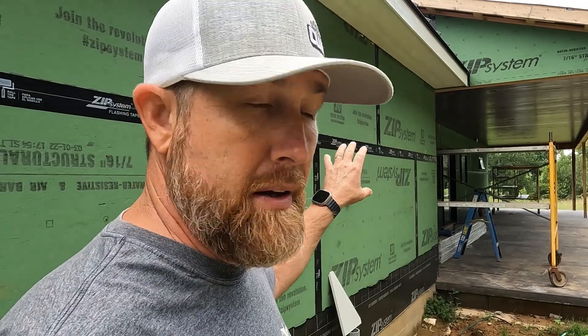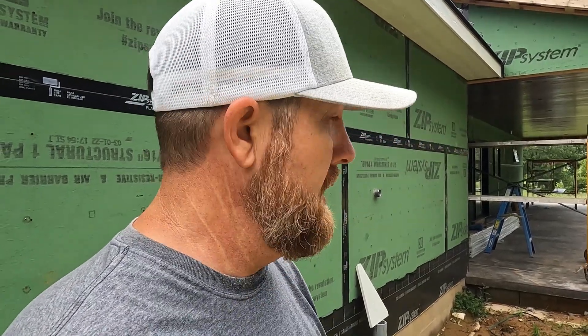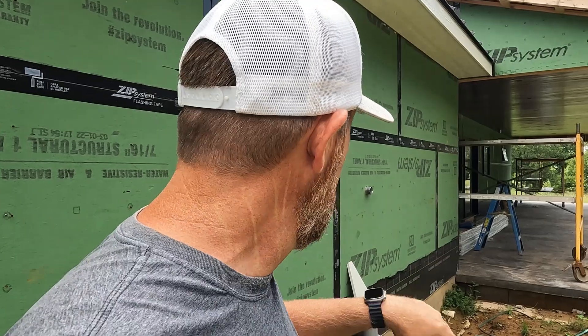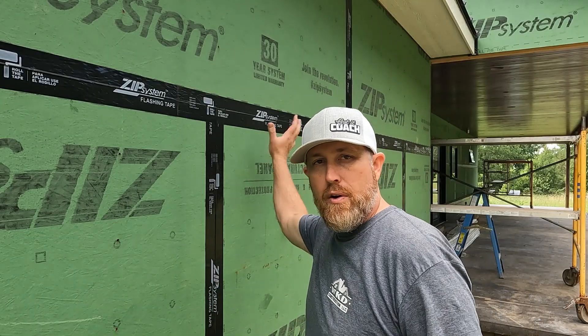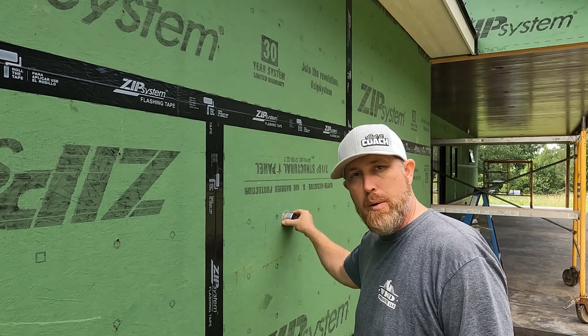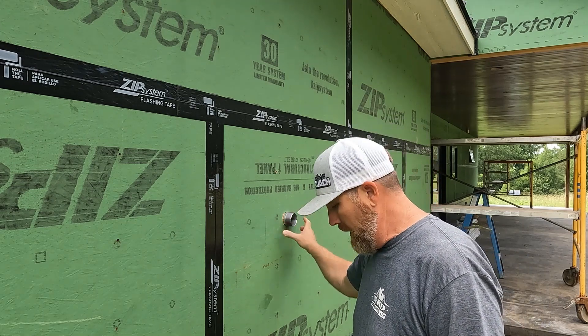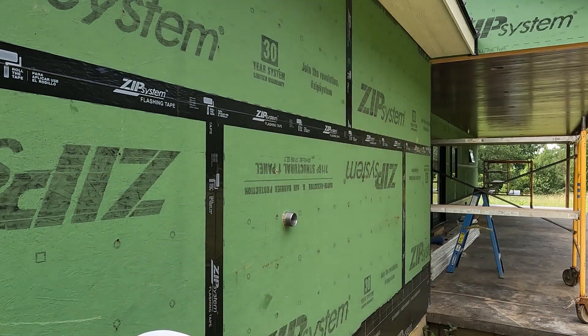We are going to mount a plate out of the diamond coat siding, flash that, and then use a ZIP system rain screen — something new that they've just come out with that hasn't been fully released to the public yet, so I'm very fortunate to be able to use it. My electrical panel is already installed inside with all the wires in there. I have my rigid nipple stuck through the wall, and here will be my 200 amp underground meter base. All of our conduit is run through the ground to a transformer, and I have it simply stubbed up with a slip collar.